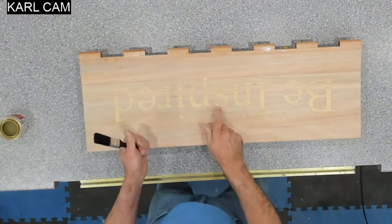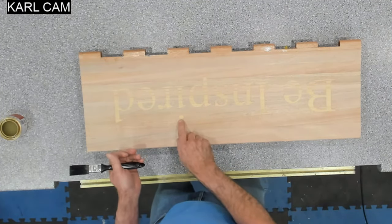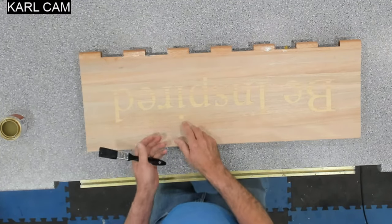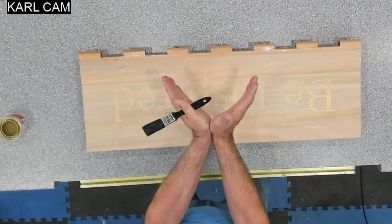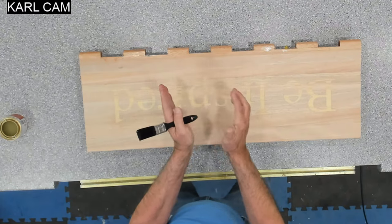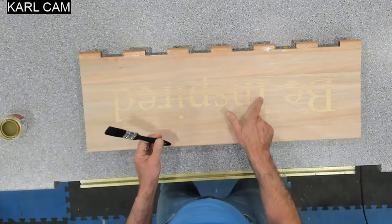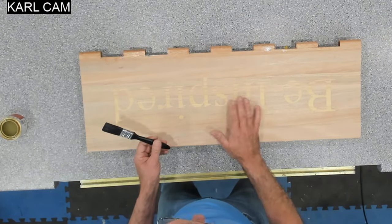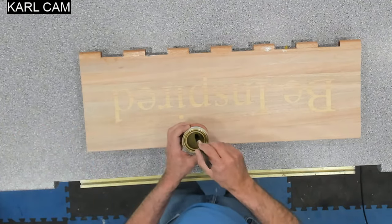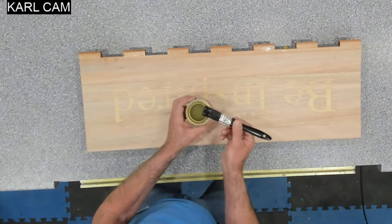Now, one of the things that I did mention is that the penetration was very, very shallow. Remember when I measured this on the CNC, I said, well, it's only 1.5 millimeters, maybe 2 millimeters narrower at the top than the opening in the hole in the female section of the door here. Now, remember, that's a 60 degree cutter, not a 45 degree. If it was a 45 degree, then every millimeter across would give me 1 millimeter penetration. Every millimeter across on the 60 degree cutter gave me a little bit more penetration. So it wasn't enough. And there are some spots here, this one in particular, that I can feel is still moving a little bit. Now I'm hoping that when I put the hard wax oil on, it will soak down in underneath that and set it there. If not, I will just put it on the CNC and take it all out. Here we go.